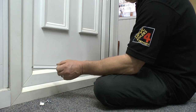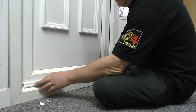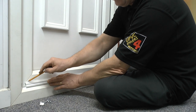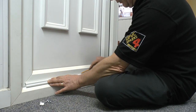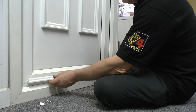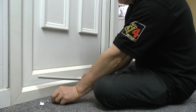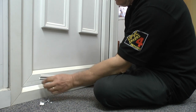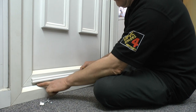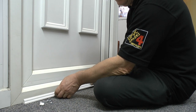Simply offer the drip bar onto the flat of the outer frame once you've cut it to size. The simplest way is to just run a pencil all the way along — that gives you the centre line for where the screws will go. You'll see that the centre of the slot, once the nipple screw has been screwed into the door, allows it to sit just above the threshold, and that's enough for it to shed the water off and run away down onto the floor.